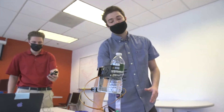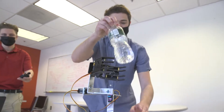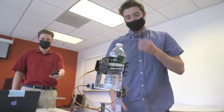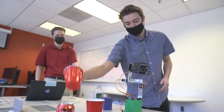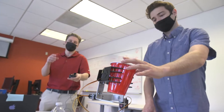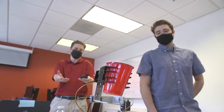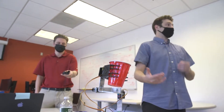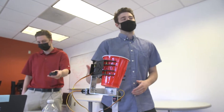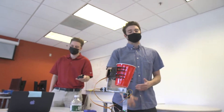Thinking back to when it was made out of plastic, it was being weighed down so much more — you can see it's really not taking that much of a give now when you put it in and out. You can also show that it doesn't crush the cup. With time constraints we didn't have enough time to re-3D print it, and the claw was mounted a little too high for a cup. But it's a lot more important that it doesn't completely crush it — it'll just be kind of floating off the base, but it's not going anywhere. The claw servo opens and closes at about 15 degrees — when we started testing we had it going zero to 180, and that was burning out the servo motor by putting too much constraint on it. By changing it only a certain amount, we solved that.